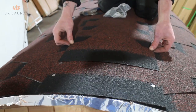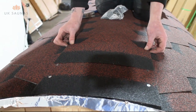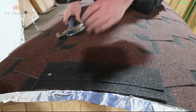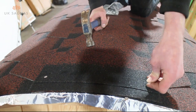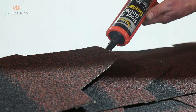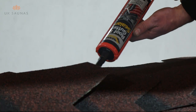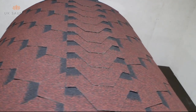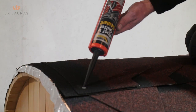When reaching the end of the ridge section, fit the end ridge tile first and then continue with the ridge tiles over the top. The final ridge tile should be fixed with just two nails and then adhesive under the shaped end of the ridge tile. You will now have a neatly shingled roof that looks like this with only two nails showing.